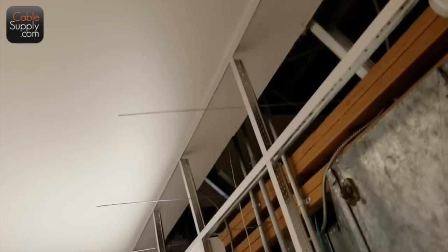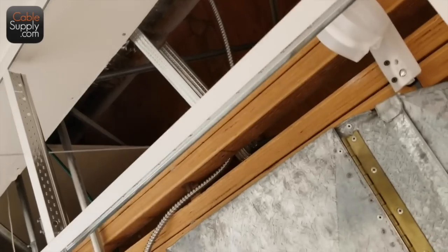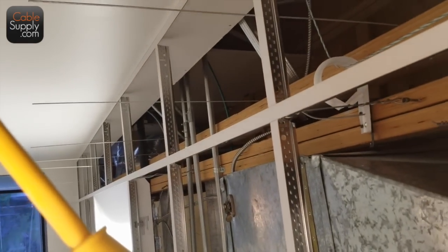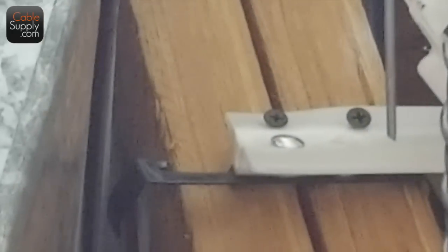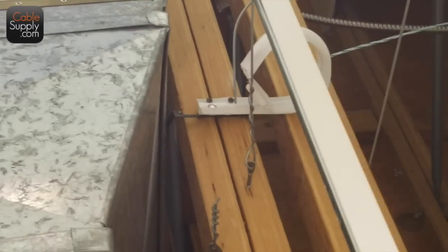That little black clip on the hook attaches to the grid wire if you want to support it vertically. We call that a bat wing. The banana clips are usually like yellow metal ribbons that clip onto the T-bar and attach a grid wire to the T-bar for extra support. I think LA and Chula Vista are the only two cities that require that. I put an exact duplicate system into New York City and one in LA — exact duplicates — and when I looked at the price difference, it was actually more profitable to do New York City than LA.